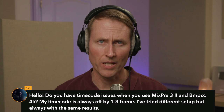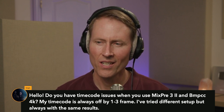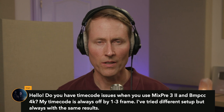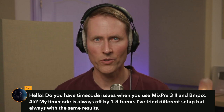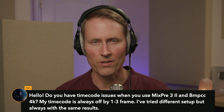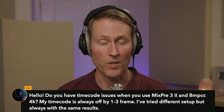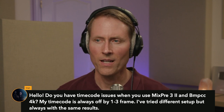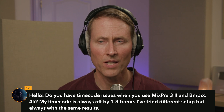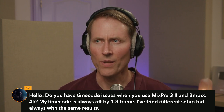I think it depends on how you jam them together. One thing that Blackmagic did, I thought was a little disingenuous. In their marketing, they said that with the input, you could jam sync the camera and then you're good to go. What jam syncing refers to is you plug in a timecode generator to the camera. The camera picks up the timecode and starts counting from there. You unplug the timecode generator and you don't have it attached to the camera anymore. In that situation, it drifts quickly because you don't have an internal temperature compensated crystal oscillator in the camera. You just have a regular real-time clock, and it does drift. And I think the problem is if you do jam sync it like that, within 30 minutes or so, you're already drifting. Even potentially within just a few seconds, you could be off by some amount there. So that's one thing that I would be careful with.